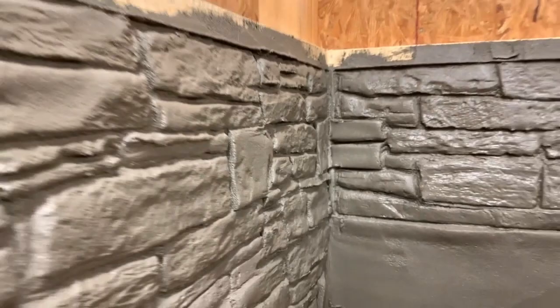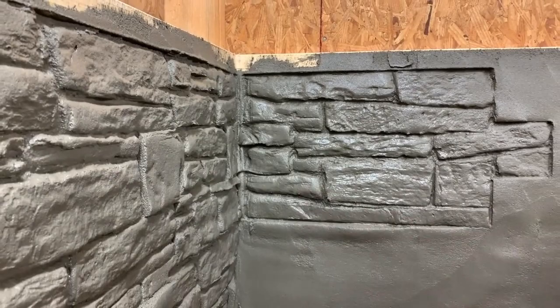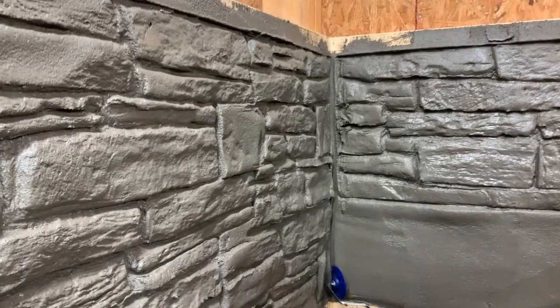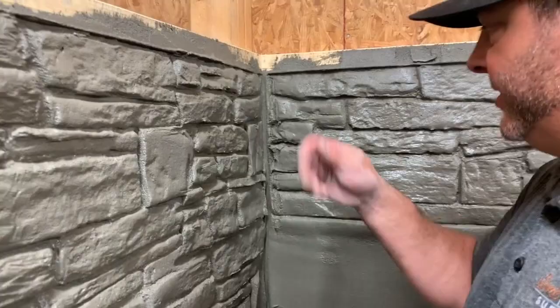I'll keep this one with the texture, and now I don't have two identical stones. I may even put a little bit of texture on one of these stones using a particular single stone stamp. Now I've created stones that have a little bit of texture and character, without having two large ones set side by side. Now is the point when I would come down and actually roll a grout joint right down the corner after stamping. All of this loose material will come out when you broom after stamping later in the process. That softens up all these stones and makes them look nice and natural. Greg Hensley with Stone Edge Surfaces — thanks for watching.